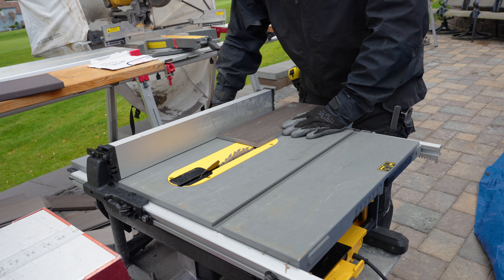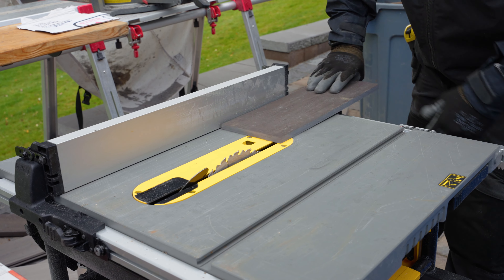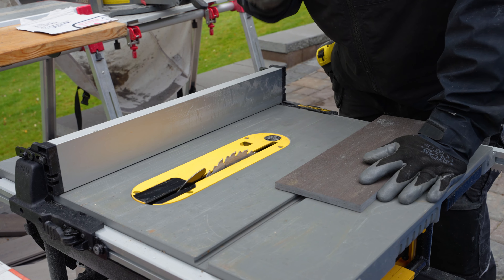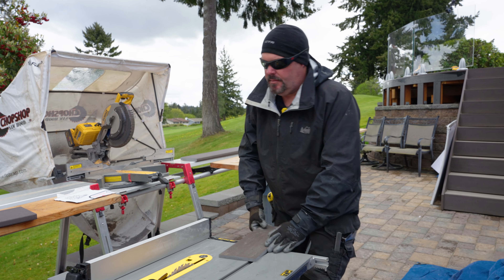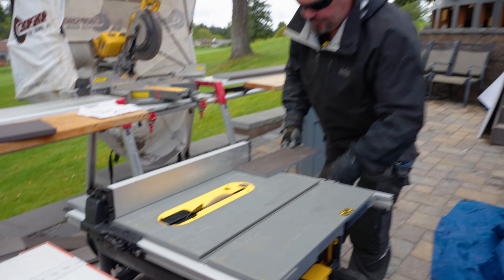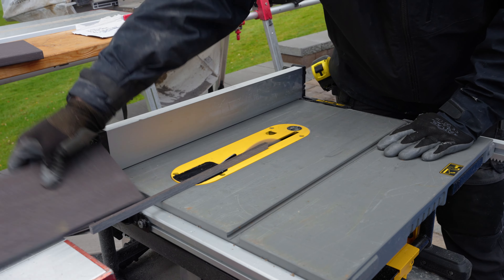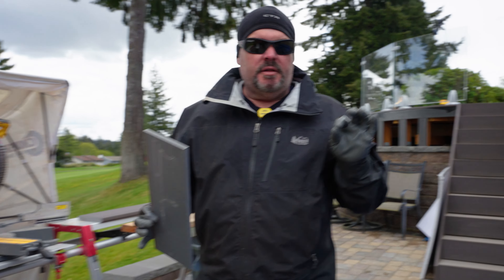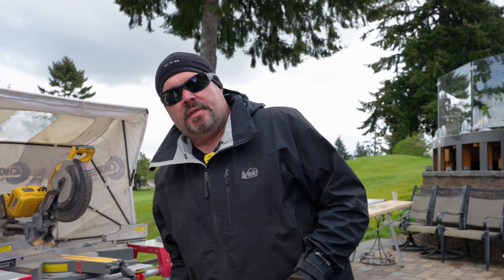Let's say I need a certain width here — I'm going to lock the fence down so it won't move, then power up the saw. If I need to put my hands anywhere near the yellow danger zone I'll get to that in a minute, but for this cut we can keep our hands well away from the blade. And that's primarily what we use this saw for.